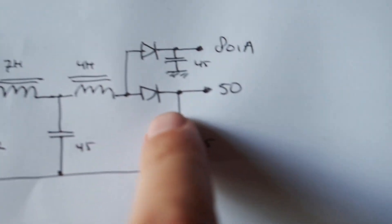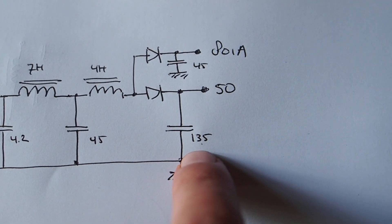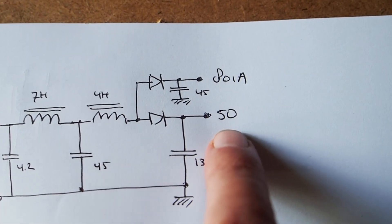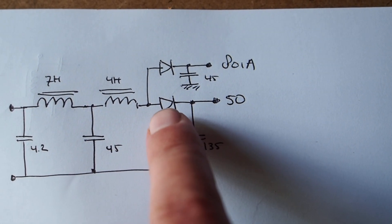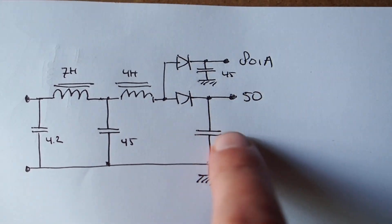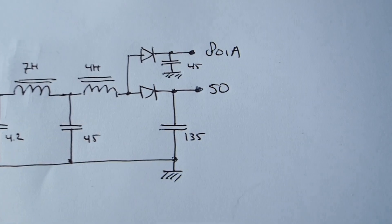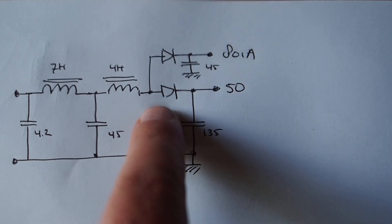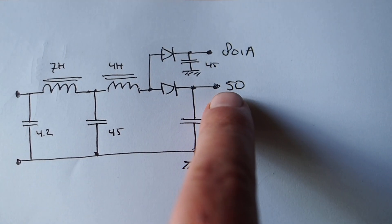I used one of the tricks from Janos from Real World Audio that he had shared in one of his Darling Amp videos. What I have done is decoupled the power supply for both output tubes - the mid and high tube and the low tube, Type 50 - by actually using a diode. This way any changes in the voltage here are not being passed through to the other capacitor bank, so both tubes are independently supplied. Where this comes into play further is in the charging circuit, because these are in counter phase.